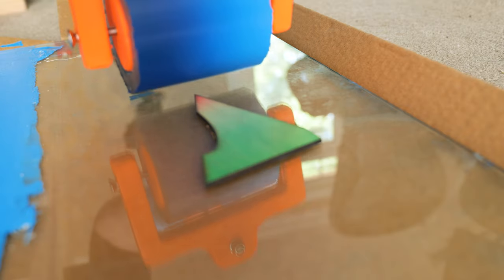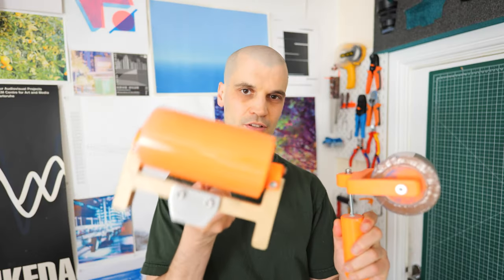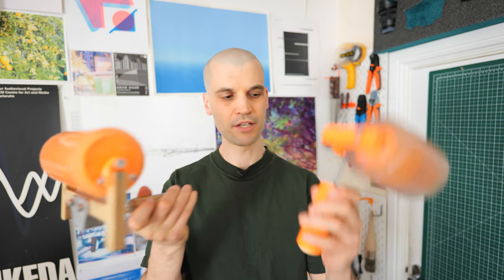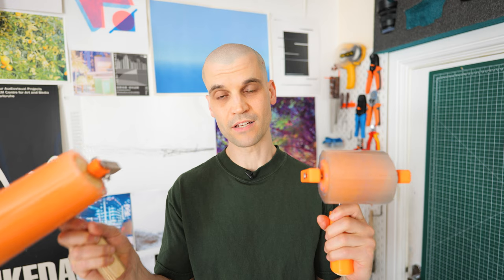I'll be sharing the 3D printed files in the description. This H-design is much better because it keeps the roller stable when you put it down, and you can 3D print the handle too, making these really cheap. I want to thank Ross for doing all the research. The polyurethane rubber will last about five to six years — not as long as natural rubber rollers, but those cost hundreds of pounds. And once it does break down you can always just recast it. Ross has been using his for years with everyday use and no signs of breakdown yet.